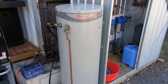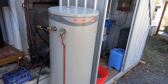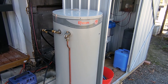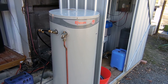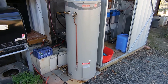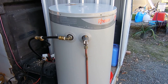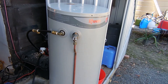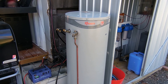Being in winter at the moment we've had a few issues. Basically the panel system on the roof is not at a correct angle to the sun and is also slightly too small in winter. We had it up and running in the last bit of summer and had beautiful hot water, but at the moment it is struggling and we've been using our gas hot water system. In summer it had no problems, but in winter it's struggling with the colder weather and mainly because of the angle of the sun.